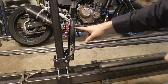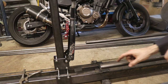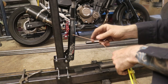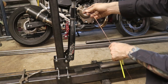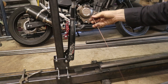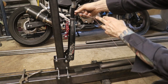I'm trying to figure out the angles — they go from the steering tube, out, then down to connect with this lower tube. It's a bit of a brain teaser. The easiest way, and I've seen other builders do this, is to use wire — I'm using welding rod. I bent up a little angle up here that I like visually, came out as far as I want, and made the other angle. I'm doing this purely visually, the way I want it to look.